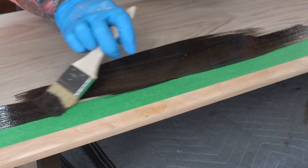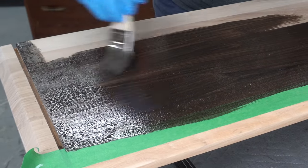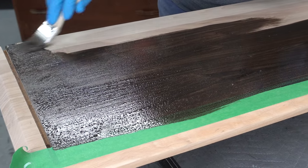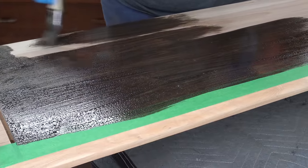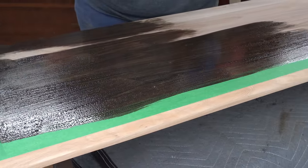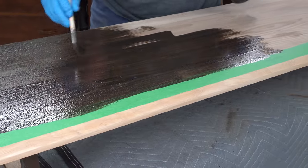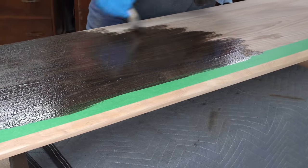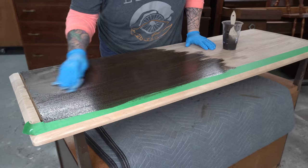The very first time I tried this exact same product I hated it — I was so used to oil-based stains that this water-based stuff was just too weird and so opaque. But I tried it again with a little bit of water mixed in just to dilute it slightly, and oh my gosh, so much better. It does have a tendency to raise the grain, so ideally you would pop the grain beforehand with a little bit of water and light hand sanding before applying your water-based stain.